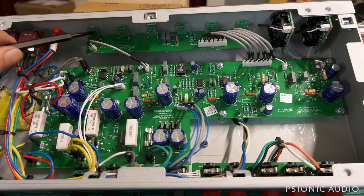That happens a lot on these Marshalls that have all the spider-mounted resistors. When the amp is on, I will carefully jiggle all these 5 watts, which are mounted way off the board, which is good and bad. If something goes wrong, it's less likely to be a heat issue on the board.